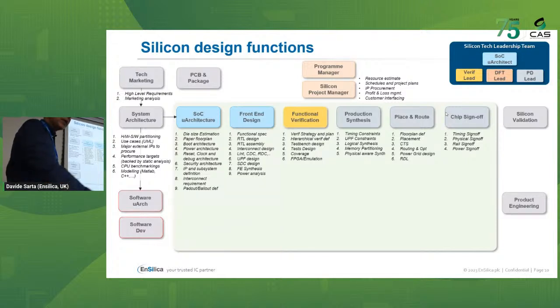Usually you don't go back to synthesis. But again, that could happen. For significant violations, you may have to request a new synthesis, perhaps because you underestimated or you haven't considered the floor plan well, and therefore the synthesis was run with a different floor plan, things like this. But we try not to go back to synthesis as much as possible.